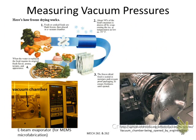So sometimes the ones we have introduced may not be suitable for that, because imagine you have a very high vacuum, that means the pressure value is very low. So if you use a regular, let's say a diaphragm based pressure sensor to measure it, the pressure difference could be too large, so it could easily damage the diaphragm or other sensing structure. So that's why for very low vacuum pressure measurement, we may need to develop some specialized pressure types.